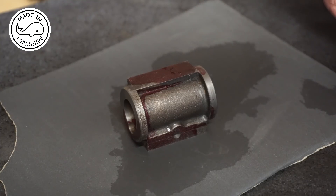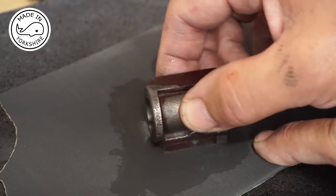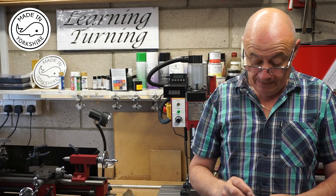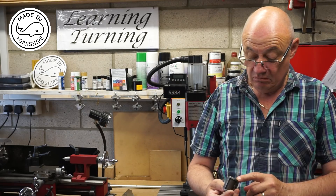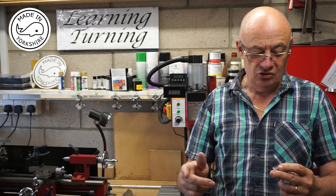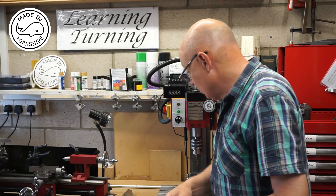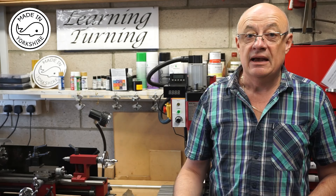Finally, using this piece of wet-and-dry on a really flat surface, I'm just going to clean up the port face. Well, that was somewhat easier than I thought it would have been. I was concerned about boring the cylinder and drilling the steam passages but it actually seems to have worked okay. I do struggle a little bit with two-dimensional drawings and trying to envisage how it would look in real life, but I think I got there in the end. My next video will cover hopefully the steam chest, the steam chest covers, and the cylinder covers.